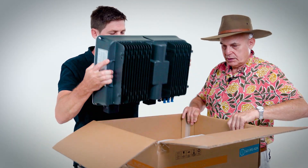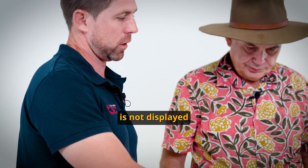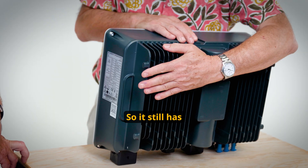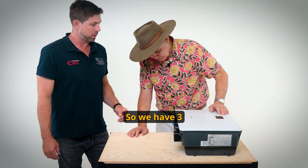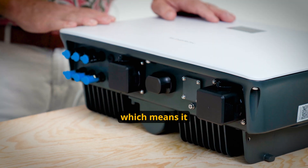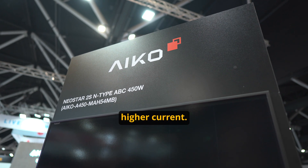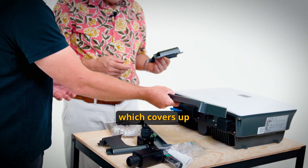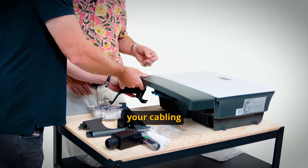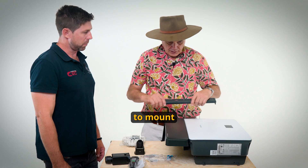All right, so what do we got? The new models have a high temperature screen. You'll find the LCD is not displayed until you press on the screen, and then the LCD will come up. Let's have a look at the underside — it still has a heat sink on the back for the active cooling. We've got three individual MPPT inputs here. Each MPPT can take up to 16 amps, which means it can accommodate all the new panels on the market. As the panels get higher wattage, they also get higher current. There's a cover here which covers up all the connections, because sometimes your cabling can be a bit of an eyesore.